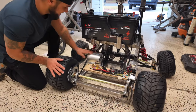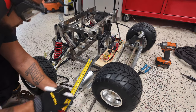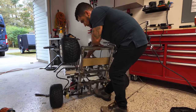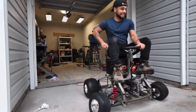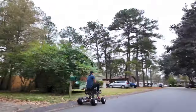We finished the go-kart, but made a massive mistake — I was somehow so excited that I didn't realize I had put the motor on backwards, which was a massive rookie mistake. I quickly fixed the problem by building another bracket, flipping the motor around, and officially took the thing out for its first test drive. It ran good, but the chain fell off a couple of times, so I tightened it up. Then it was officially time to put the trash can on.